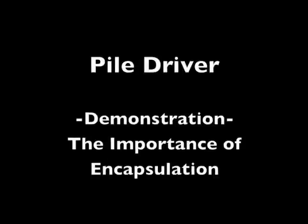Now that we've taken a look at the two sensing face concepts for metal face proximity sensors — thick face and thin face — it's time to take a look at the different concepts for encapsulation. Pepperl & Fuchs Piledriver uses a full encapsulation. We feel this is very important to give maximum shock and vibration immunity. Some of our competitors don't do that.